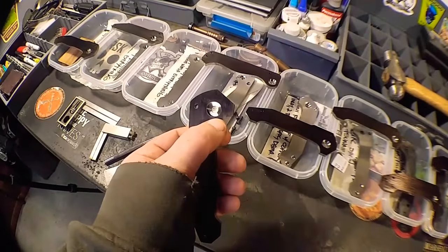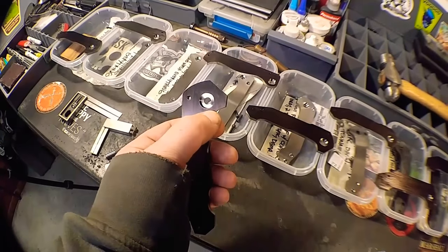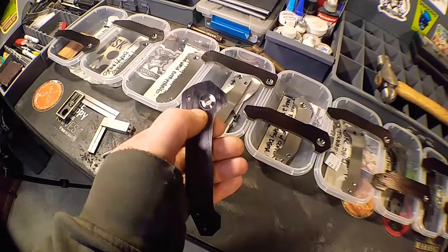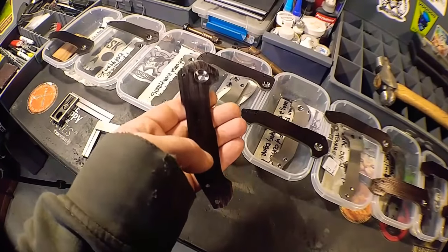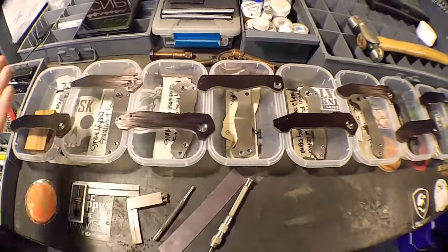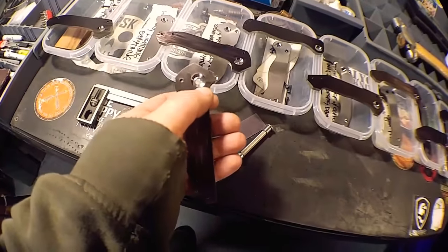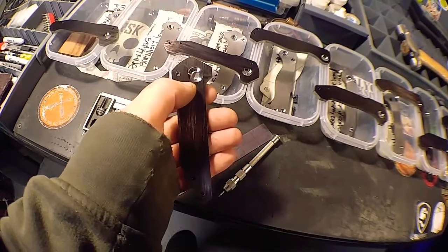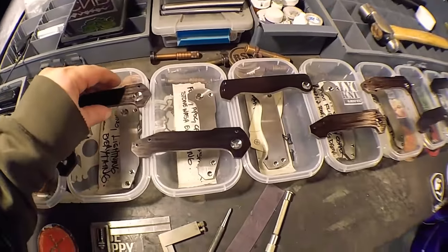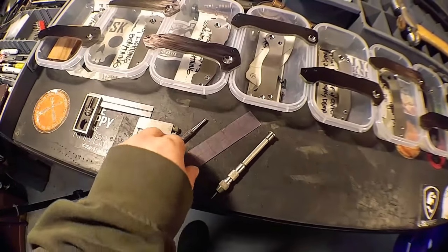Basically, my lock bar is going to come and hug the cut right here, is going to come and hug that counter bore pretty much as close as I can get to it without being into it, okay? And it's going to come to just past the end of the counter bore and come straight down to about right here, okay? And I just know that from doing so many of them. It's just like second nature. Each one of these is exactly the same. It's going to hug that counter bore, come out just past it, and go straight down to about here on every single one.